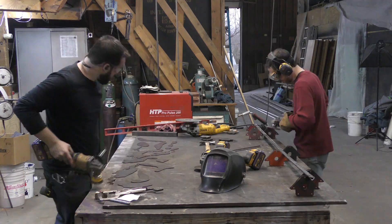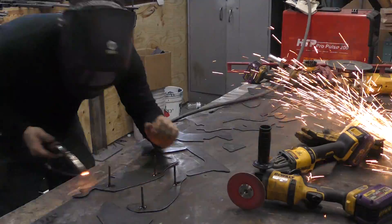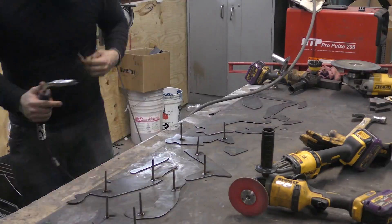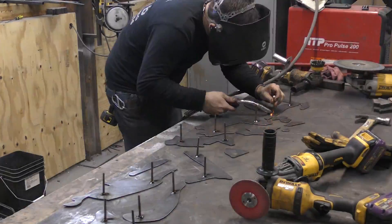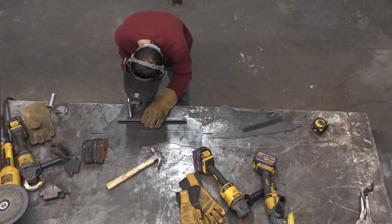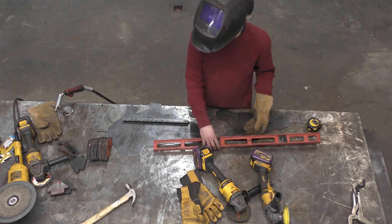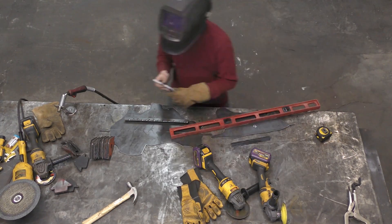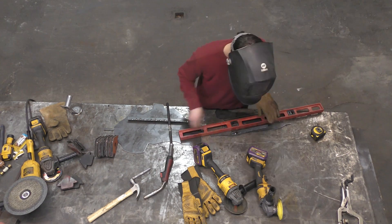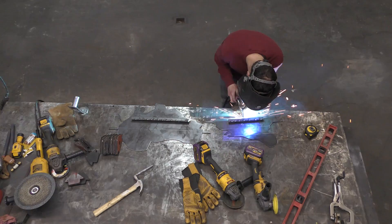Now as Stu makes another piece of the metal portion of the French cleat, I'm preparing all the little islands that make up the world, just by wire brushing them. Then I'm going to go back in and tack on some 1.25 inch bolts — I'm just tacking right from the head. We did burn off the zinc coating on there with some muriatic acid, just so we're not huffing that with this much welding. One or two is not a big deal, but when you're doing 30 or 40 like we did here, you really don't want to be breathing that. We've got a big update coming to the channel really soon — we're going to be adding stud welding to the processes in the shop. I had the stud welder here but didn't yet have studs in, so these ones got done by hand. We've got a good comparison to how to do it faster with a nice piece of equipment.